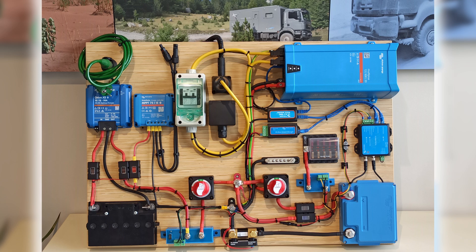One question people have asked is: why do we use a battery protect for the chargers if we control them directly with the BMS? Well, there are a couple of reasons why we use two battery protects. The first is as a measure of fail-safe we learned in the overlanding market. When your installed chargers fail for whatever reason your adventurous life throws at you, and you need to emergency charge your smart lithium battery with a locally found external charger, it must still be possible for the BMS to switch it off when needed. Otherwise you can easily damage your expensive battery in the field. This battery protect can do exactly that, as it is controlled by the BMS.